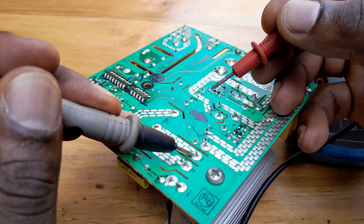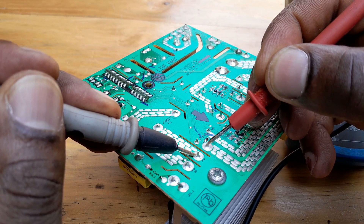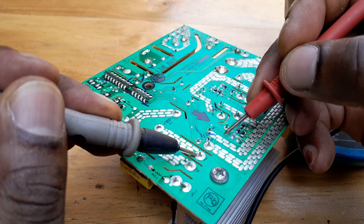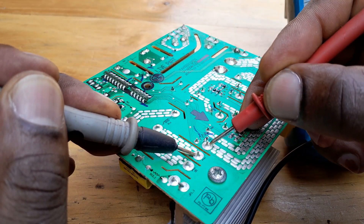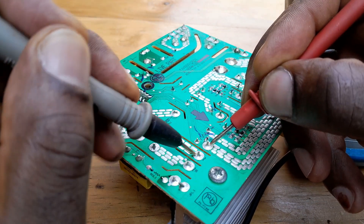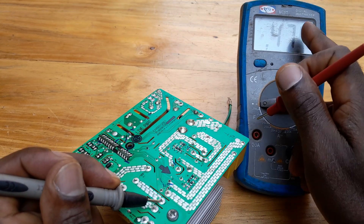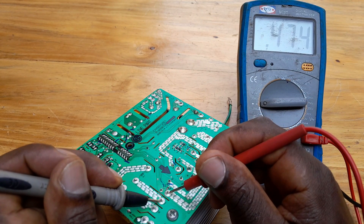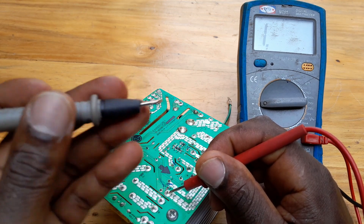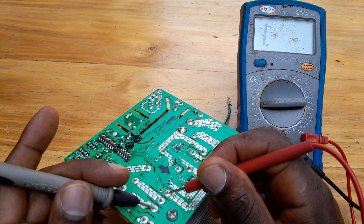And through the negative here, you should read 474. It means the diodes are in forward bias — they are forward biased. So you can check here. And also if I move this probe to this other AC input pin, it should give the same reading.